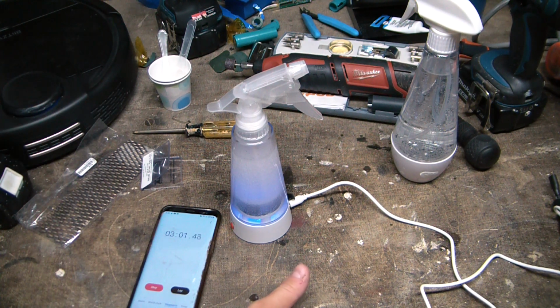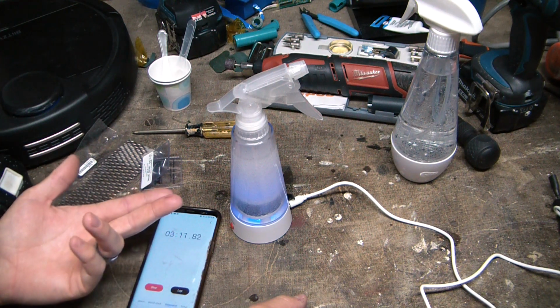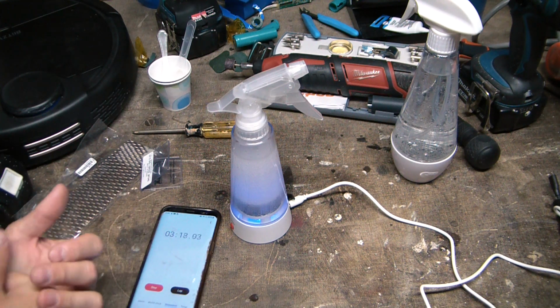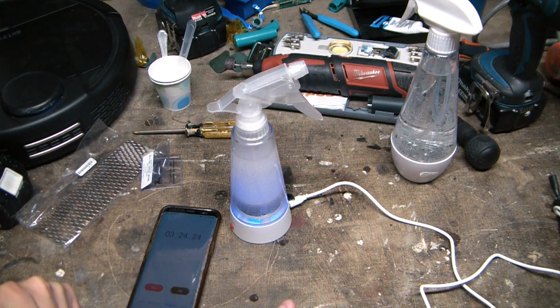I mean, you don't get a more aggressive environment for degradation than a DC electrolytic cell, well, a hypochlorite cell, where you're actually electrolyzing salt water, taking one of the oxygens from the water and binding it with the NaCl, forming NaOCl. It's pretty nasty, and the fact these aren't degrading, they have to be mixed metal oxide.